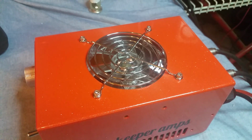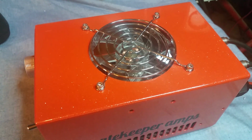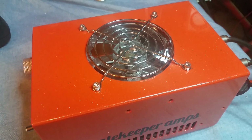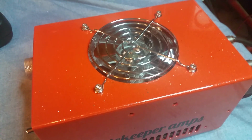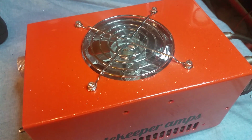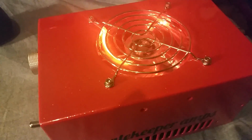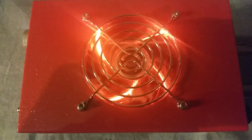So here you go right here, man. About $12. It's a clear blue LED fan, and I bought about 8 of them. So I did the same thing I had to do with your last fan and took the blue LEDs out and installed some bright orange LEDs in there for you. I'll go ahead and demonstrate that now. He said you can't get an orange 92 millimeter LED fan, big brother.